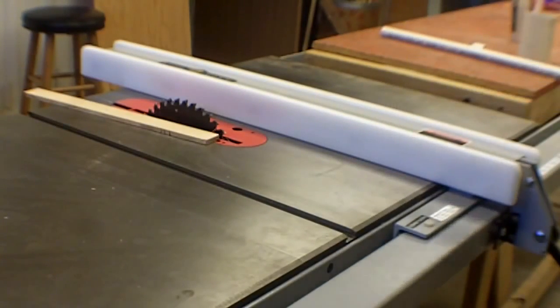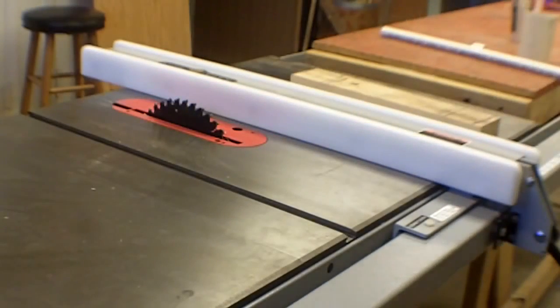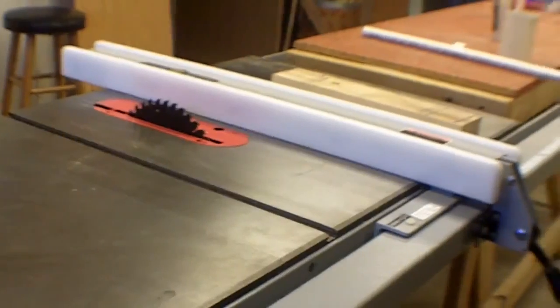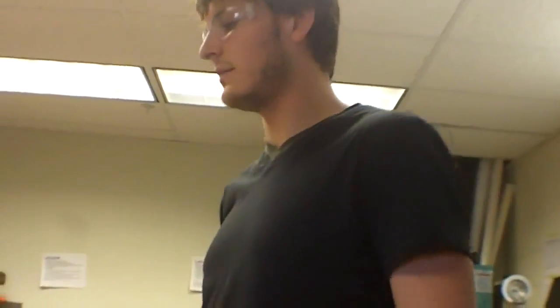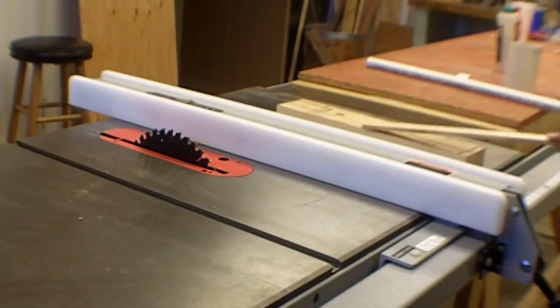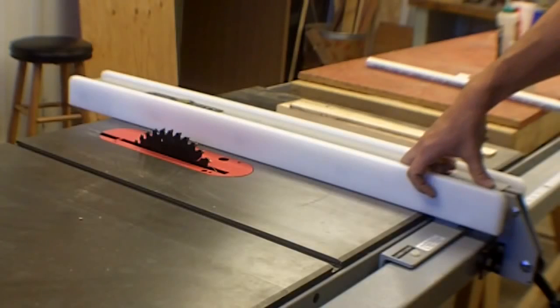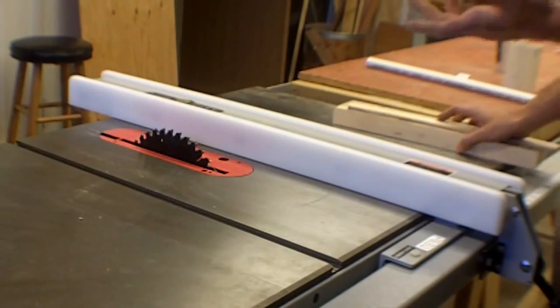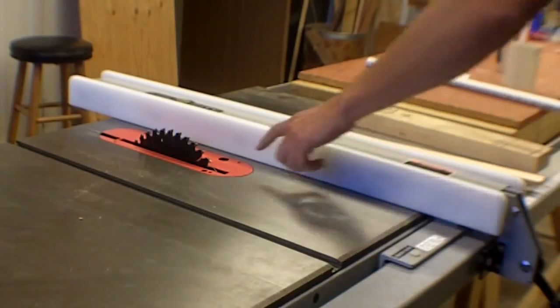This does not cut metal. It'll do great on plastics and composite materials. With a different blade it can cut metal, but blade profile matters — the number of teeth and shape of the teeth varies. For acrylic sheet it works but has a tendency to tear out along the cut; a different blade type gives much better results. Those specialty blades are generally about twice as expensive.